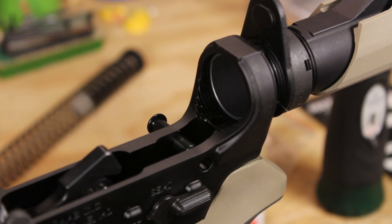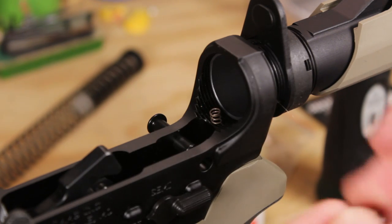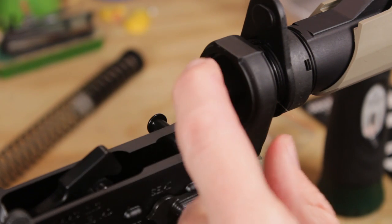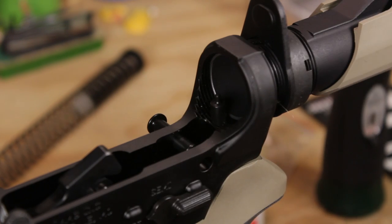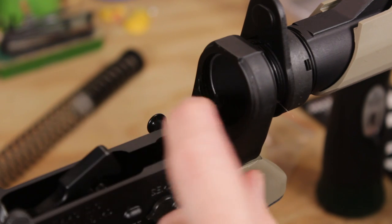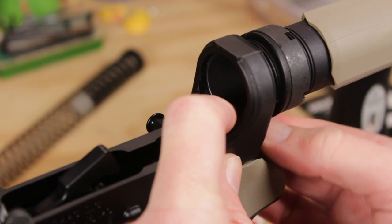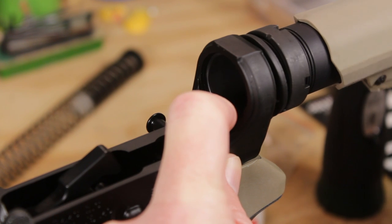Here comes one of those commonly launched parts. I won't say that I've never, okay, yeah, I have done this. But you just drop the spring in that hole. Detent goes right here. And then I'm going to have to hold this down while I make my final revolution with the buttstock right here, and then it should hold that in place all by itself. We'll see how well this goes. And I do have to watch out for that little spring that I have on the underside.